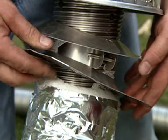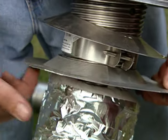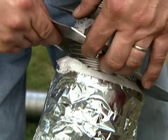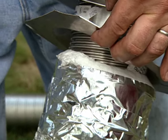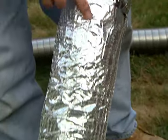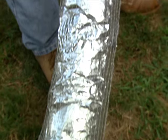This piece here will silicone right down to that flue tile and glue it right down. Below all this: ceramic wool insulation, a blanket wrapped around with foil, and then this armor mesh to protect it while we drop it in so we don't rip it.